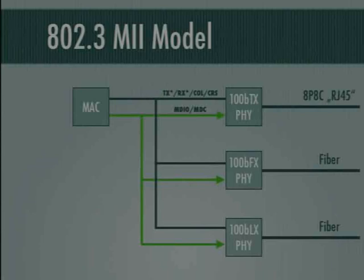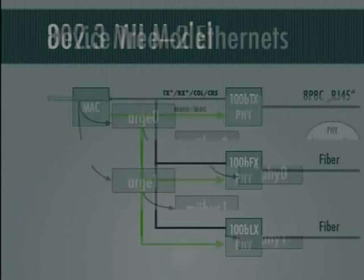So you have the actual data transfer lines. Those are here in the back, and they form one bus that goes to all the PHYs. And you have a second mini bus of two lines, MDIO and MDC, which is I/O and clock. And those go to the PHYs as well. And that is the way the CPU, through the Ethernet controller, can tell the PHYs what to do. What's important to remember is that only one of the PHYs can actually be actively involved in any data transmission. So only one of the three can be active at any time. And that is reflected in our driver model.